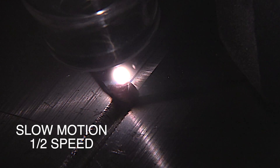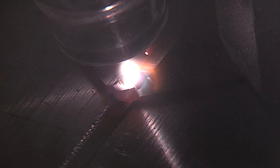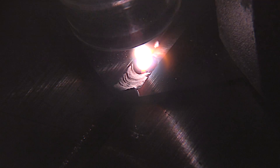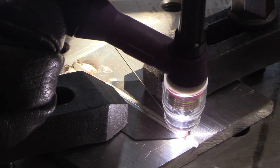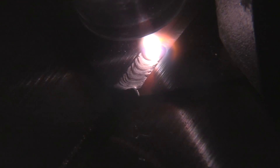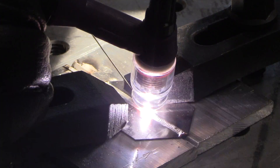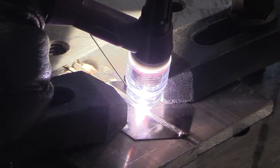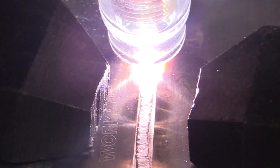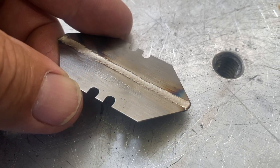Watching the rear end of the puddle - watch it start to flow, but I start traveling before it gets all the way to the back of that tack. This has been a method that works really well for me, especially on crack repair starting from an end where the weld has to be blended off afterwards and you have to maintain an edge or dimension. When welding something this thin, you want to get that rod in there often and not step ahead too far each time or you'll blow a hole. 33 pulses a second is high enough to agitate the puddle with just a little flutter.